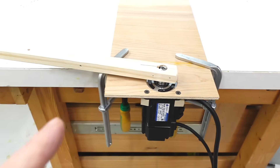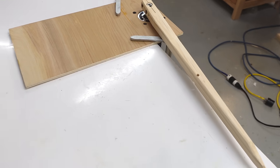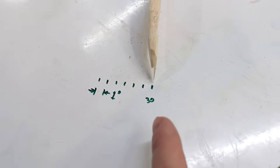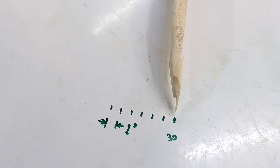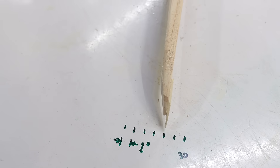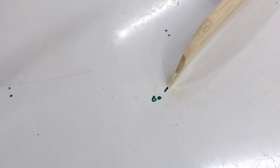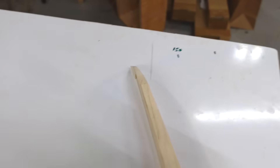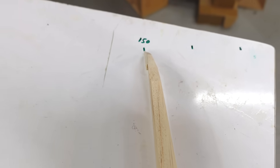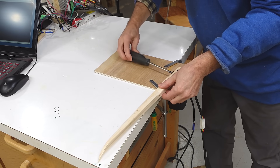I realized I could check the servo's accuracy just against itself. I got the servo on the edge of the workbench with an arm, and I've marked where it is when I tell it to go to 0 degrees. Then I tell it to go to 30 degrees and you can see it hits that mark very closely — those increments are actually degrees, so it hits that well within a tenth of a degree. With almost 180 degrees marked out, it repeats those marks very consistently.